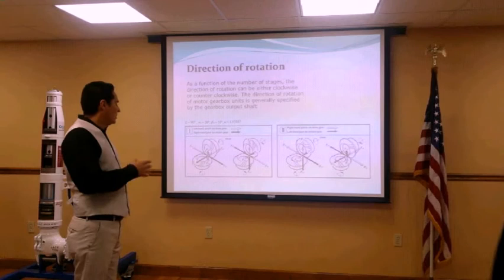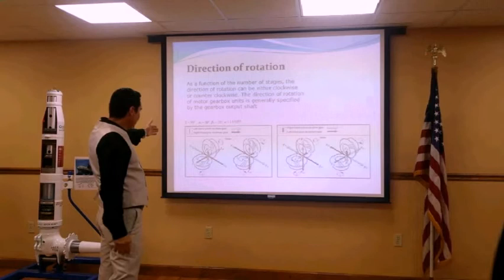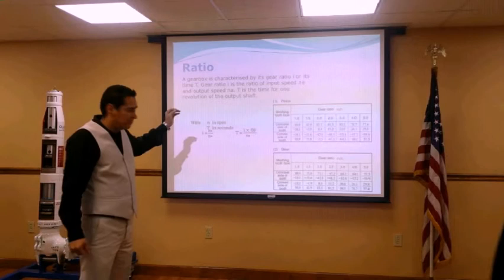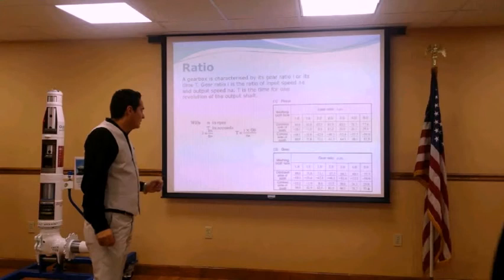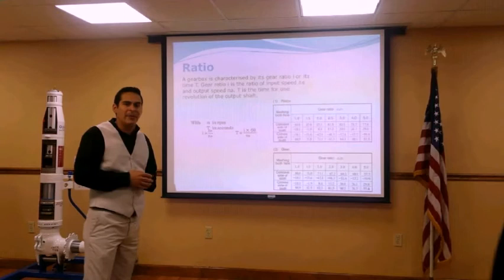Since the mechanism we chose is the spiral bevel gear, you can see it has the pinion and the gear. Depending on how it rotates — from the left-hand side or the right-hand side — we'll be choosing the gear ratio. For our gear ratio, depending on where you have your pinion and your gear, whether it's rotating clockwise or counterclockwise, you'll have your concave side to concave or convex. We'll be talking about in the next slides how we did the calculations.